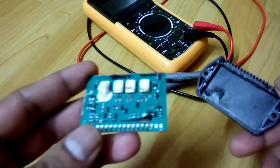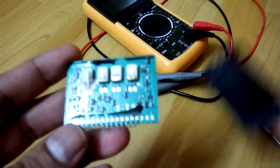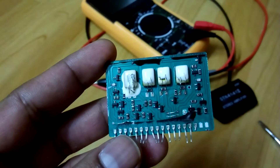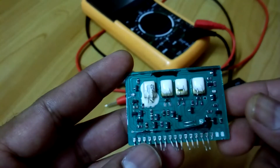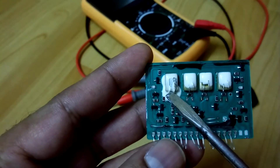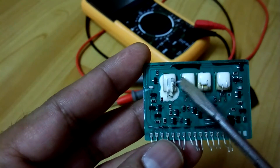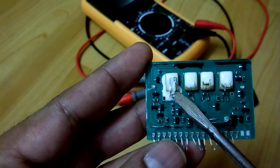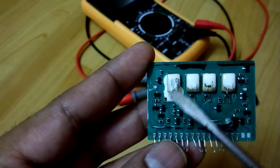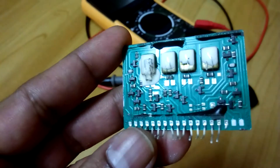As you can see, this is just a plastic cover — nothing but a cover — and this is the main chip. We can see there are four microchips here: two for the right channel and two for the left channel. And this one here is blown, so one channel was done.